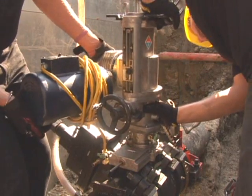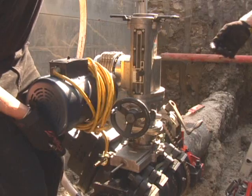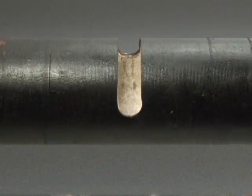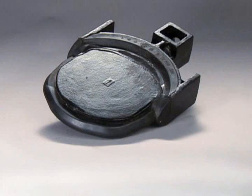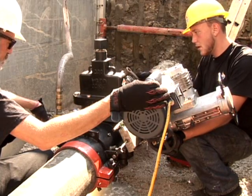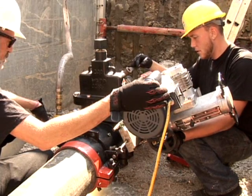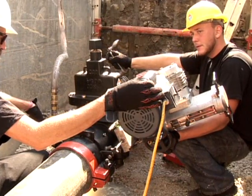The cutting unit is installed to the temporary valve. The cutting system only cuts a 1 and 5/8-inch diameter slot, 120 degrees across the top of the pipe, which allows the resilient wedge gate to be inserted into the pipe through the slot. The EZ valve system is the only under-pressure cutting system that keeps the pipe's integrity intact, because of its patented slotting technology.